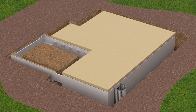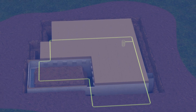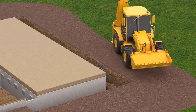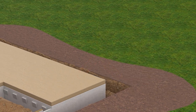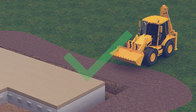Once you've confirmed that the top and bottom of the panels are braced and drainage for the wall system is in place, you can begin backfilling. Please note that operating heavy equipment near foundation walls can adversely affect the Superior Walls panels. Keep heavy equipment at a safe distance when backfilling around the foundation.